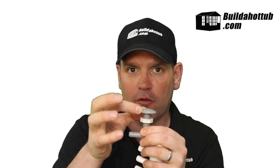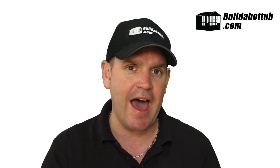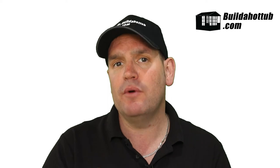These could quite easily connect into a mesh structure that we can then drop into the seat before we fill with concrete. If we cover up the top, we can have the pipework hidden and the body of the pepper pot sunk into the concrete. The profile of the pepper pot top is very low, so you wouldn't feel it on the seat, but what you would get is additional air and additional bubbles. We would connect this to a separate blower — so we'd actually have two blowers on the hot tub: one that works on the main jets, and a second blower just for the additional bubbles and the smaller pepper pot style jets.